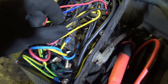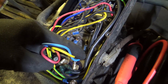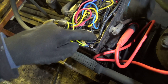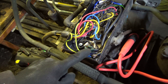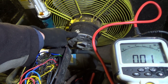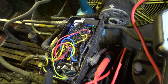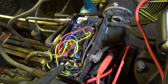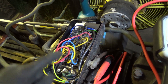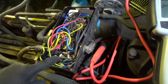Probably the easiest thing is to get the nut driver and pop these wires off here. I was saying we might just pull the wires off the compressor first — pull them off there, and that'll isolate the compressor, because it could be the fan motor. I doubt it's going to be the control circuit, because the contactor would be isolating the three-phase supply. Although it could be going back up the neutral for the fan motor, because it's a single-phase fan.